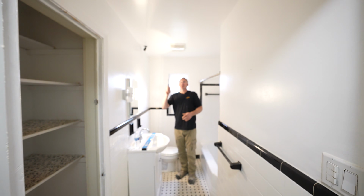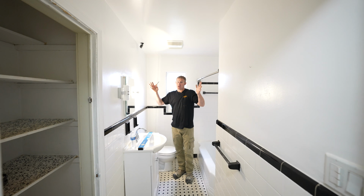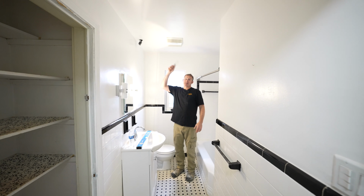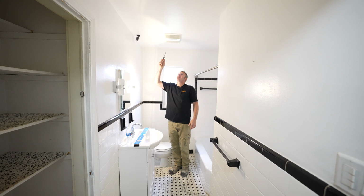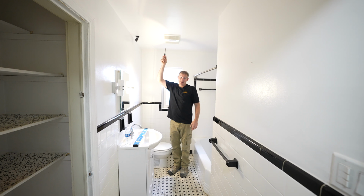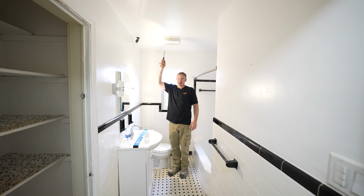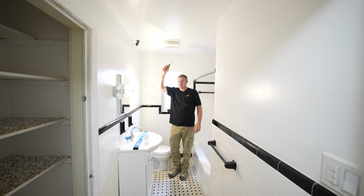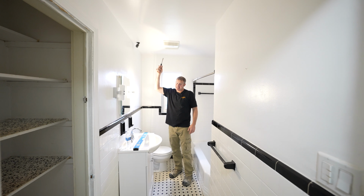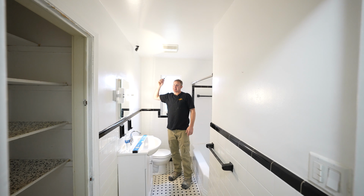Okay, so when it comes to a vent fan and electrical, that's a big question area too. A lot of times in these older bathrooms, if it was a 50-year-old bathroom, the vent fan was added at one point, and you don't know whether it's going to have actual venting going outside the roof. So that's kind of a tough one to decipher. You can either get up into the attic and find that out, or see some kind of vent going outside of the house.